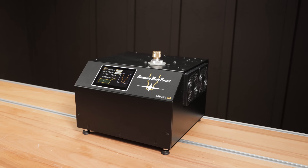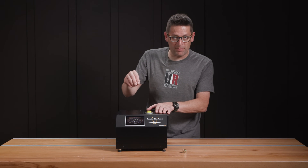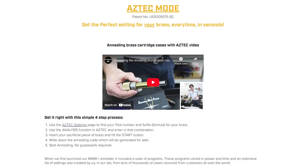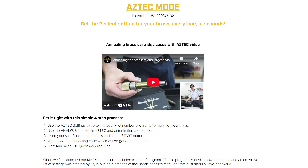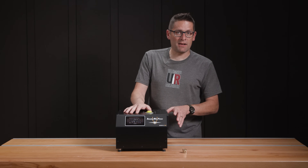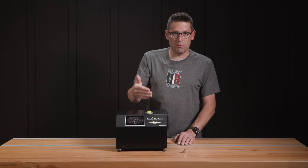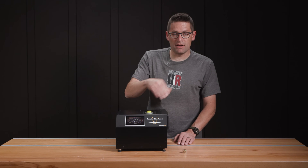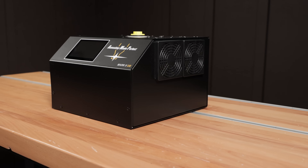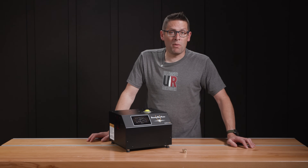The AMP Mark II DB is an inductive annealer with an induction coil. We're going to drop cases in and it's going to do non-contact annealing — no flame needed. It also has Aztec, a technology developed by Annealing Made Perfect that takes a sacrificial case basically up to the melting point, just shy of the thing giving way. From that, the firmware in the unit can calculate exactly what the optimal annealing settings are. It's got an automatic mode where we can drop a new case in and it will automatically anneal. The biggest new feature with the DB is the touch screen, increased fan circulation, and it can anneal anything from a 17 caliber all the way up to a 50 BMG.